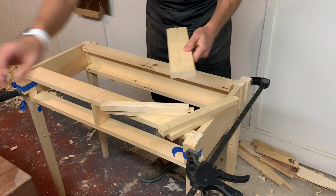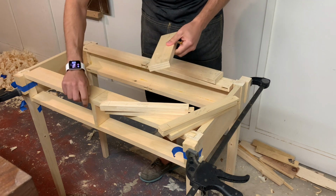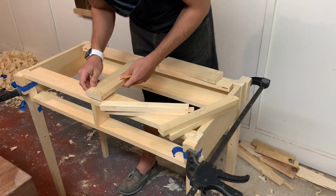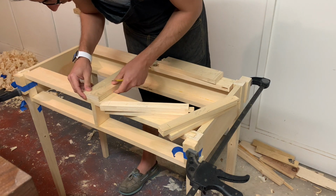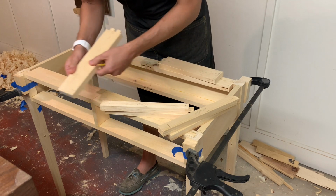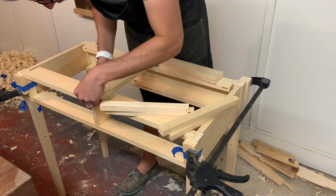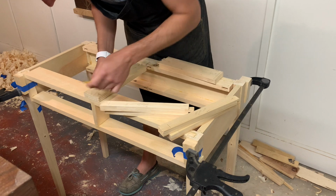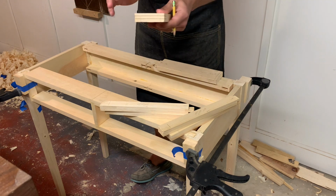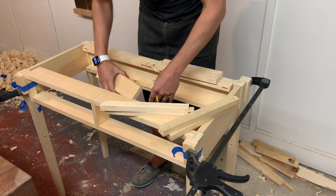With these two here, it's very important to consider this right here. I don't want to compromise the dovetail or the top or bottom rail at all. So what I'll do is set it on my middle here, and then I will probably mark the extremities only. So I'll just make tenons on the very edge and not in the middle. Number 6.